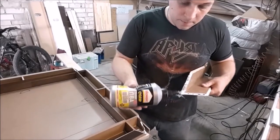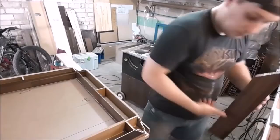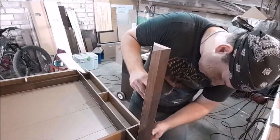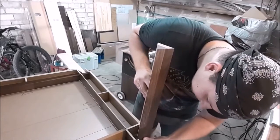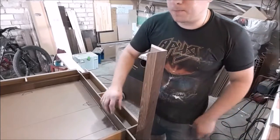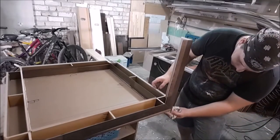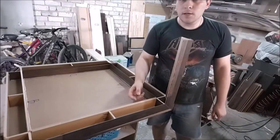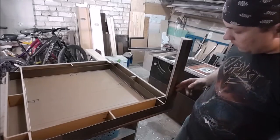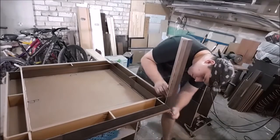We need to cover by glue all surfaces of attachment — all porous edges. We need to cover all surfaces with glue. I'll wash out the excessive glue later. Even if glue remains somewhere, you can remove it with the help of a wooden stick. That's an advantage of this material unlike wood. A small quantity of glue is much worse than excessive, because a half-empty joint will very soon break up.